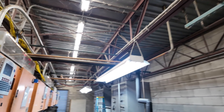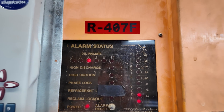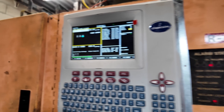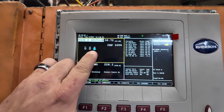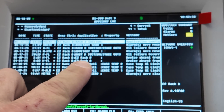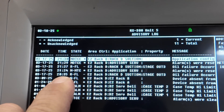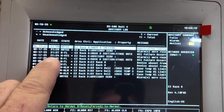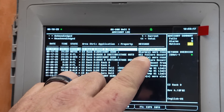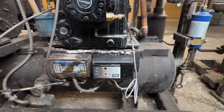So right here we have one of our nicer, bigger racks. You can see that we have oil failure here on three. Come over to our controller — you can see that the guy locked out the actual control right here. So we come in to alarms and we can see that last night we had an oil failure at 20:35. Then he logged in and looked at it about an hour and 24 minutes later. He reset the alarms, had an oil failure again.